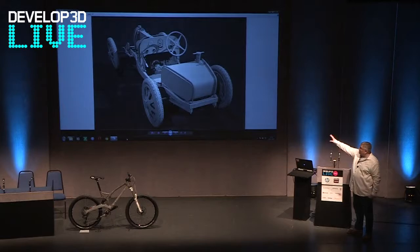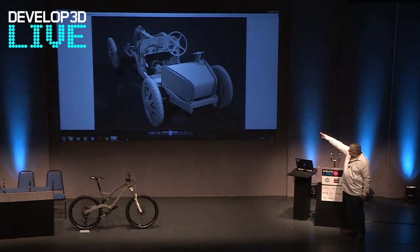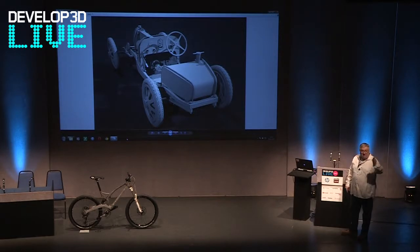One of the most important things was the fit and finish of the vehicle. An example is Bugatti wheels — if you look at most old-style Bugattis nowadays, they've got polished wheels. That's not how they came from the factory; they came as a really rough casting. The trouble is, if we step forward another 30 years, all the people who even vaguely knew about these cars won't be around, and the only people left will have a vested interest in promoting cars worth a lot of money. So we spent a lot of time making sure the finish and manufacturing were right. Although this picture is grayscale, the tubes that cover the fuel tank — they used to chop up oxyacetylene red tube, put it over a metal tube, and that was their retainer for the fuel tank.